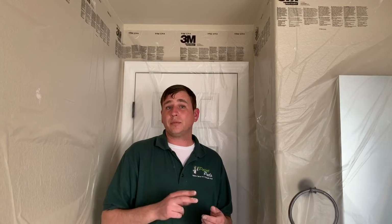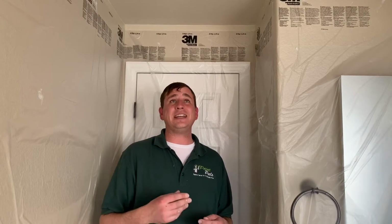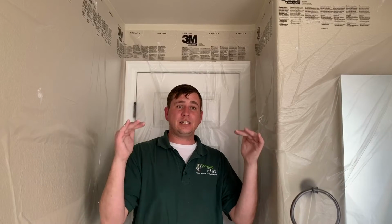The first being that you're not going to have as many brush strokes or imperfections show up in it, and then the second being that the way light hits a ceiling is a lot different than any other surface in your house. And really any imperfection in the drywall, anything like that, is really going to show up unless you're using that flat sheen.